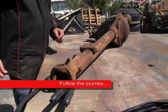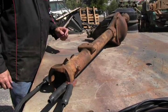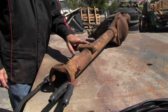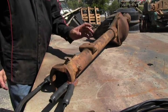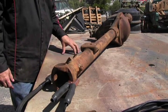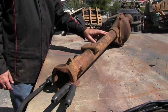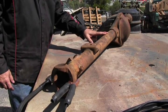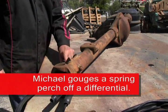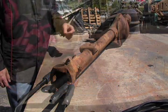It's Michael V here with Hypertherm Plasma Cutting Systems. We're going to be working on a differential. Typically you'll need to take the spring perch and either remove it or move it inwards or outwards depending on what you're doing on a custom car. In this case, Mike is modifying this differential to be used in a Wrangler, and we need to remove this perch and the shock mount. We're going to use the gouge mode on the Powermax 45 right now.